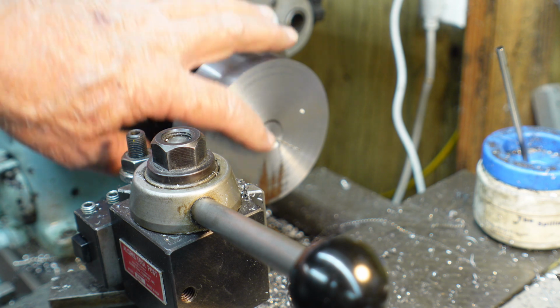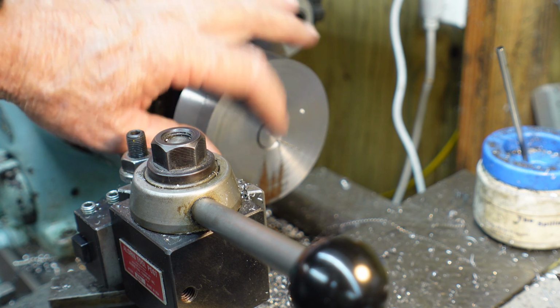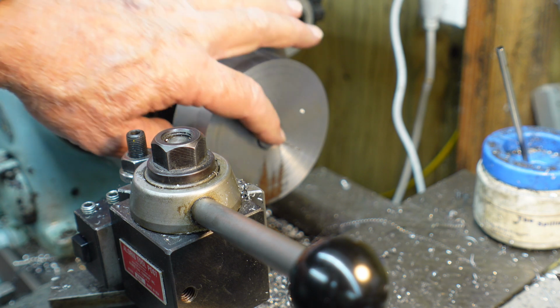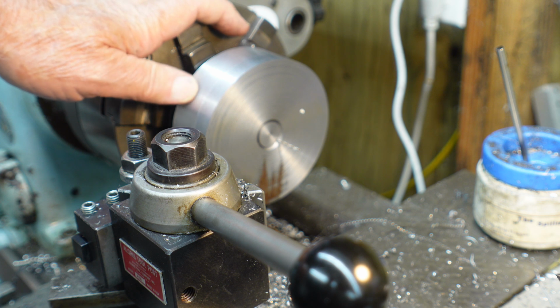So I had to cut a 58 thousandths flat on the stub arbor, and then you put the drill bit, or you put the spacer in there, which I'm using a number drill because that's the size it had to be. I was trying to get some welding rod to fit, but it didn't fit. And I've already tested it right here, and you'll see it.